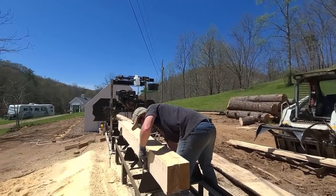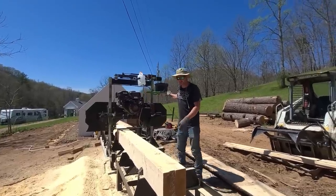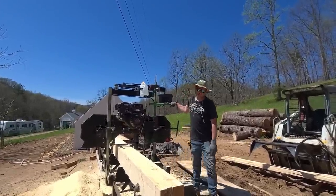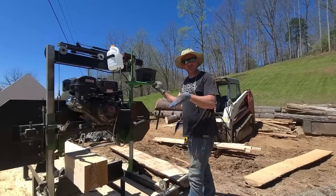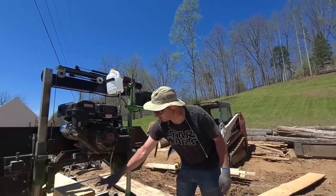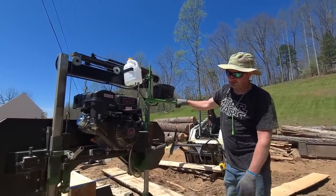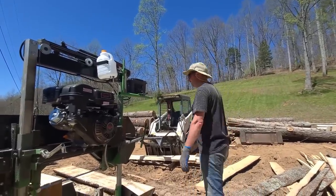It's correct. At this point, you could reset your zero. Since I just removed everything, the blade right there is a zero. So tell it it's at zero. That reestablishes its safe point, so it doesn't have to go the 1, 2, 3 that we already cut. Now it thinks of that as the top, we'll hit next, and it goes down.